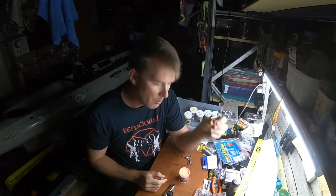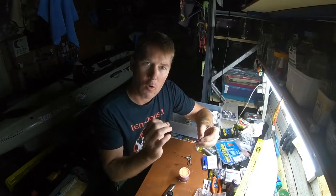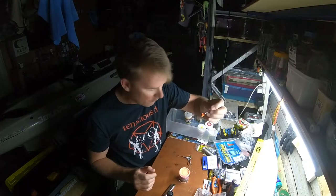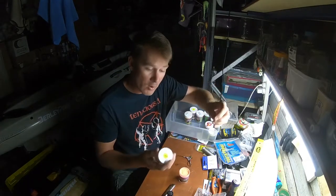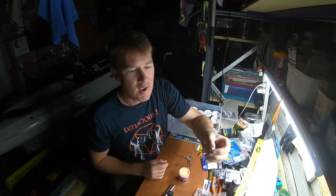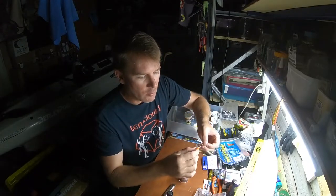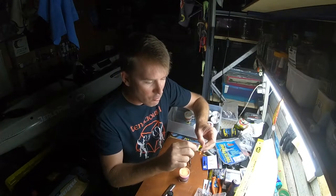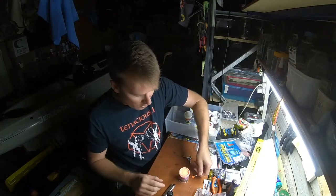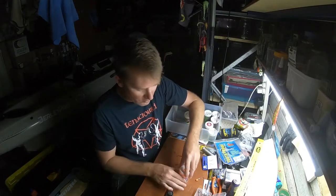Once you've done your powder coat, it's not a super hard rock-hard finish straight away. Take your jig head, hang it in your wife's oven, leave it in there at about 180 degrees for around 20 minutes as it says on the packet, and when you take them out they will be rock hard. The only other bit I do is get a tiny little drill bit and run it around the eyelet at the top to take the powder coat off the two eyelets.